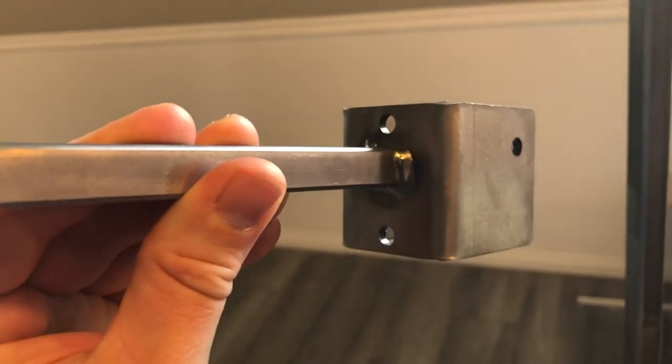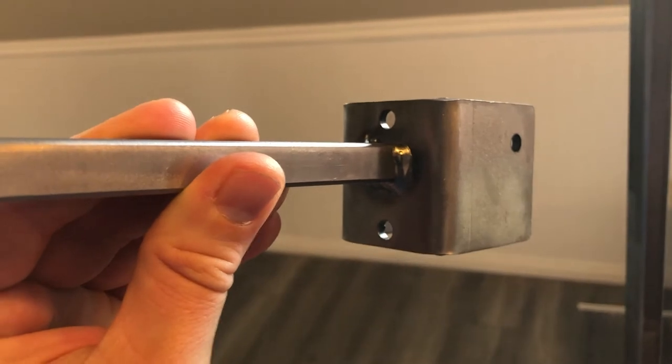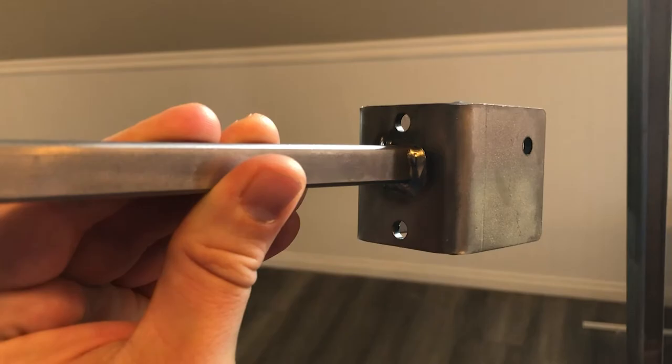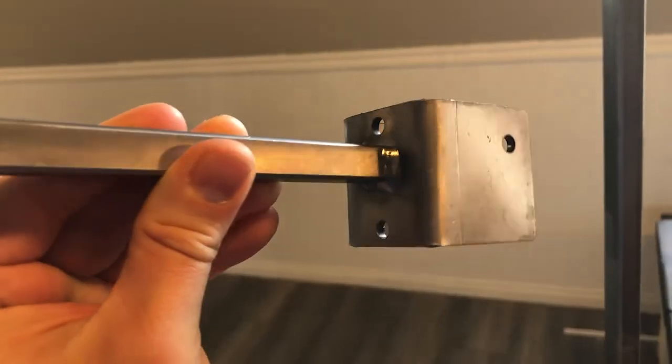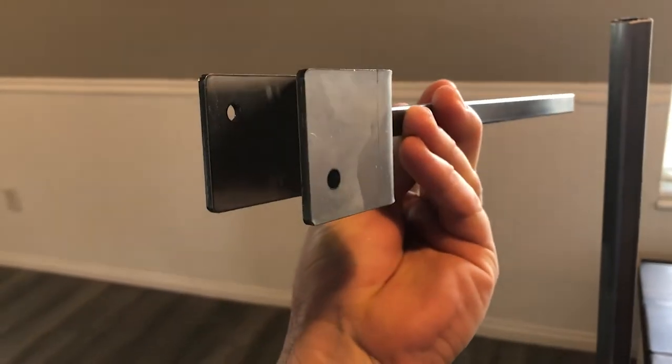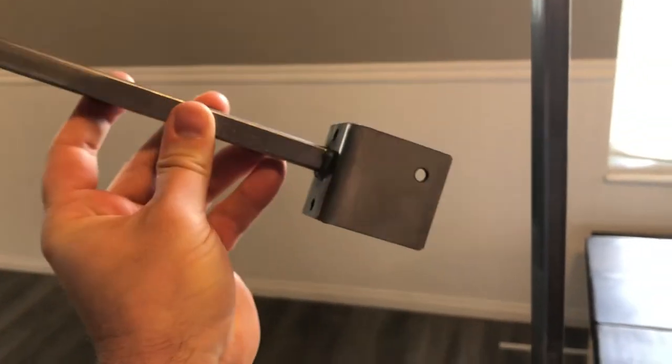This is the FS10. It features a half-inch tube, which allows for 2-inch thick, low-profile shelves to slide over and still hide the hole. Each bracket has a top and bottom. The side that is the top of the bracket has a 9/16 of an inch lip. The U-shaped design of the Stronghold bracket allows for easy installation after sheetrock, with only a 2-inch by 2-inch hole.